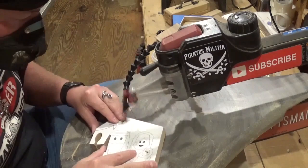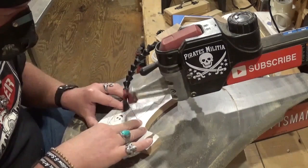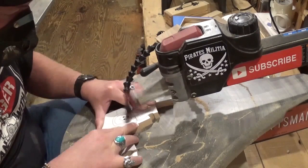I'm just taking my time and letting the blade do the work here. It took me around 35 minutes to cut everything out. Oak is a harder material, and if you rush the job you will get burn marks on your scroll saw pieces. As I always say, I'm just taking my time and guiding the blade along the line.